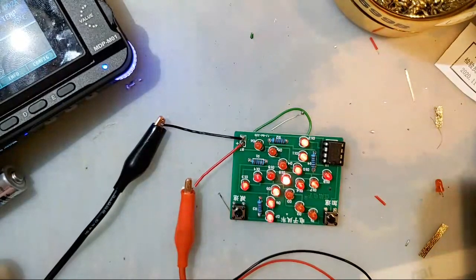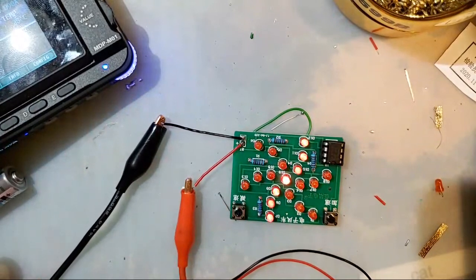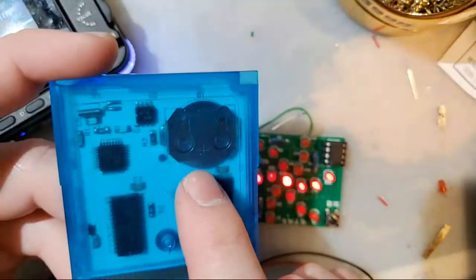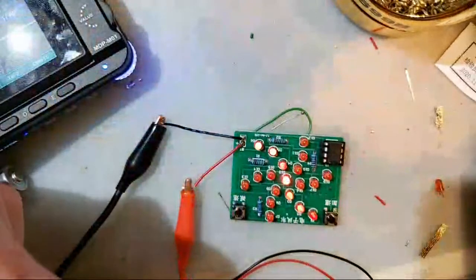And yeah, on some games you can just buy battery holders. That's usually not a thing on OEM Nintendo games, but if you're soldering together an aftermarket flash cart, those are usually built for battery holders, and you can use untabbed batteries that way. That's perfectly fine, but only if your cart is built for that.